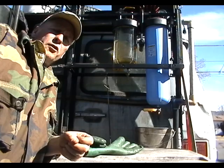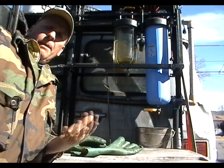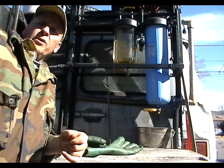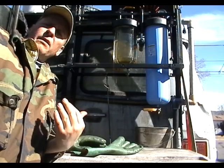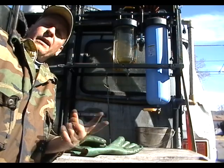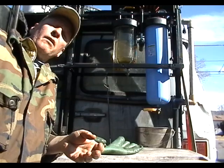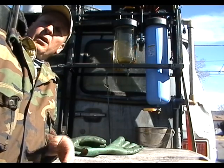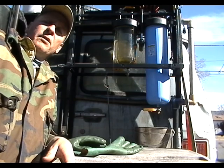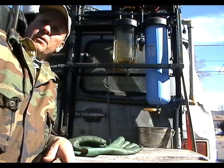Backflushing the filters took about 15 minutes, and the draining of the traps and filters took 15 minutes before that. Then what I'm going to do is drain the gasoline out of all the filters and traps, and put all that into the processing tank, and then top the tank off with vegetable oil, and then it'll be ready for processing another 20 gallons or 80 liters of blended vegetable oil diesel fuel.